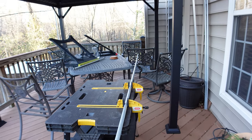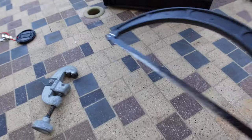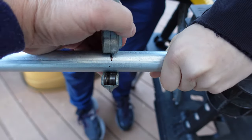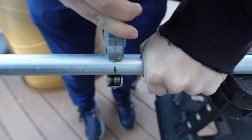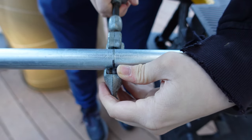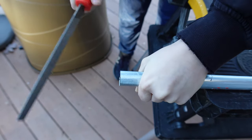Our installation is going to have four eight-foot poles. We have ten-foot conduit on a workbench and we're going to cut it at the eight-foot one-and-a-half-inch point, so the hole is down one-and-a-half inches from the top. For cutting you can use a hacksaw — we happen to have a pipe cutter, but you don't need it. Line up the edge and blade, make sure the rollers are flat, then go back and forth to make a groove. Be careful not to let the cutter travel and make multiple grooves.